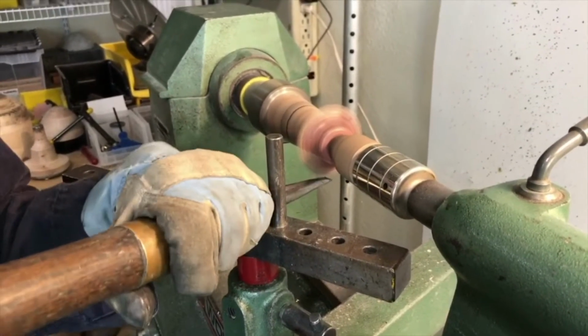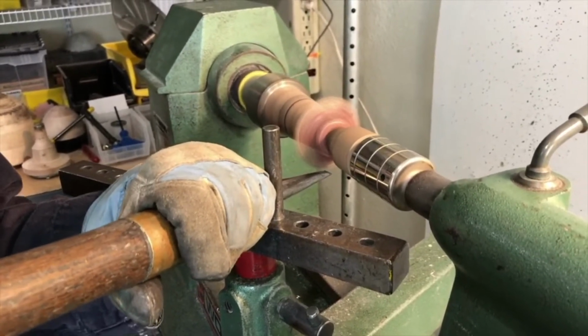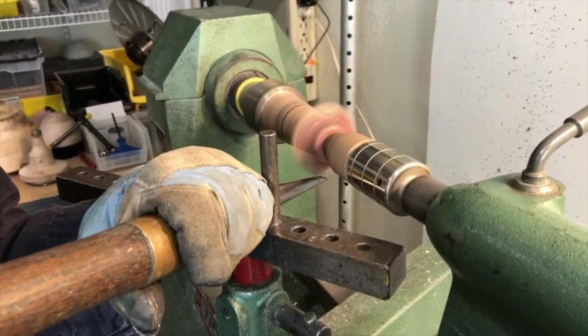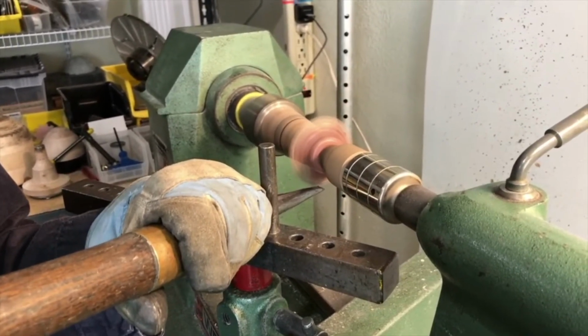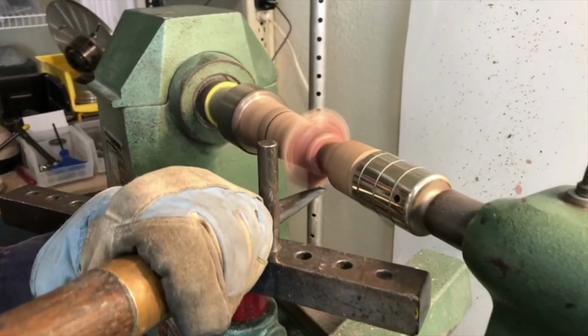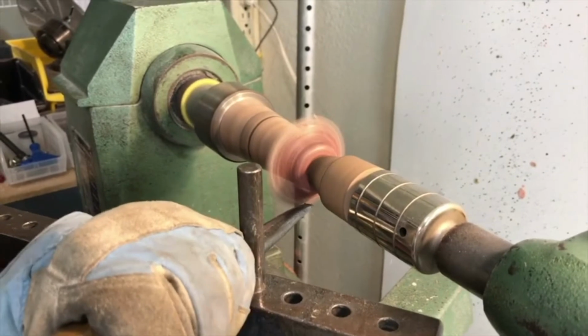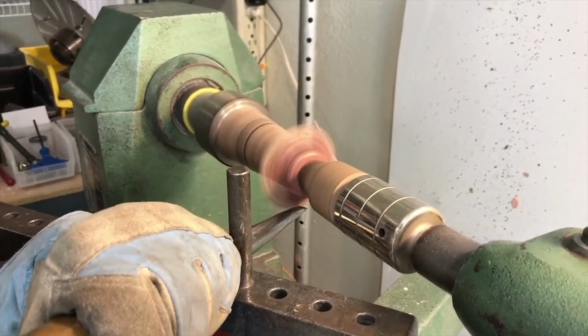And the rim is not going to compress, or I would not try and compress the rim very much, because it's basically lots of little solder seams, and it's not going to be very flexible, and you're just going to get failures and cracks in those solder seams. So I'll finish forming a basic acceptable shape. Obviously, if this was a component of another piece, I'd have some dimensions and measurements I'd be trying to set it to.